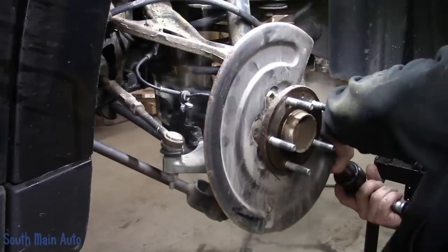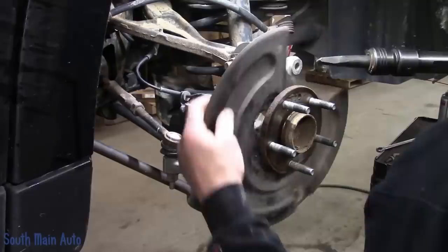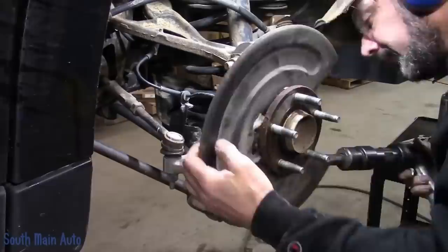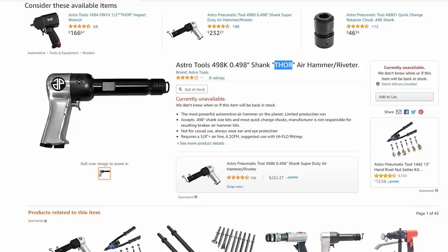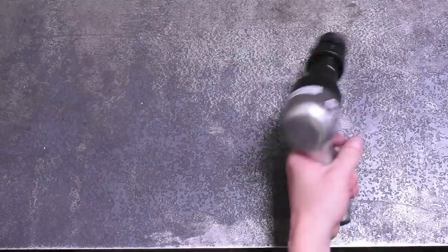Feels like you're operating more of a Browning machine gun than what you might expect from an air hammer, and you should have some CFM and PSI to feed it so that it's happy. This one dropped wall pressure 10 to 15 PSI more at the wall than 0.401 shank air hammers during use. But there are more 0.498 shank models out there — no doubt we'll eventually find and test models able to unseat this one from its new spot at the throne, even if it takes a few more pennies or we have to turn to the same brand yet again. Appreciate you joining us on our journey towards harnessing everlasting air hammer happiness. Click subscribe to catch the next episode, and thanks for watching.